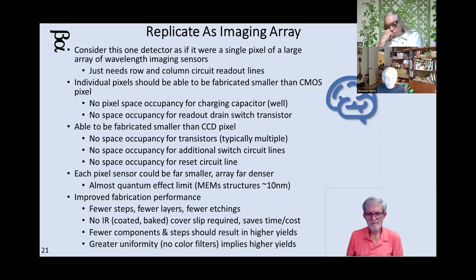What's the typical pixel size nowadays? The limit here is 10 nanometers; the typical pixel is around 3 micrometers. A nanometer is one one-thousandth of a micrometer, so you could go literally 300 times smaller and still not deal with quantum tunneling effects. You could have 300 by 300, meaning 90,000 times as many pixels as a good quality camera can have today. So this would be good for making higher and higher resolution cameras for a long time to come.